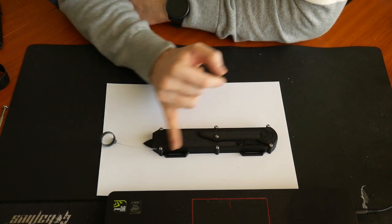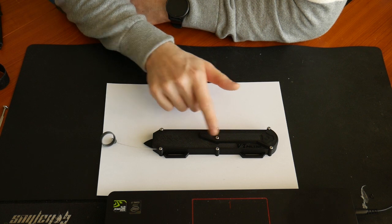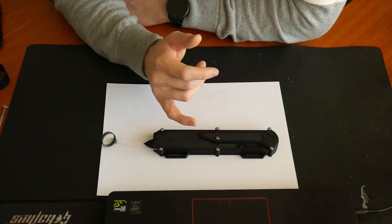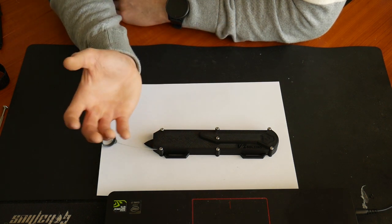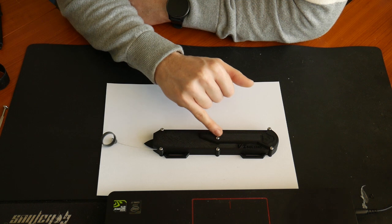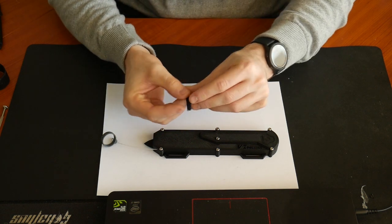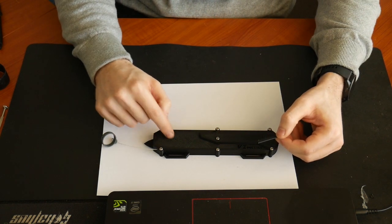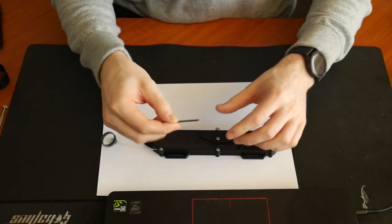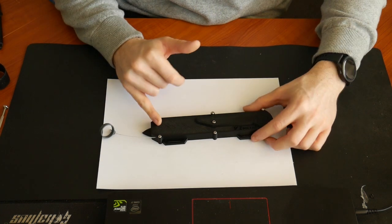You can see there's just that bit at the bottom that snapped off. I think I know why this happened - it's because of the gear ratio. We've only been looking at it in one direction, from the back towards the front, where it's a 1 to 32 ratio. But if we look at it from the front to the back it's 32 to 1 - quite a significant gear reduction - which means there is a lot of torque and rotational force developed at the end of this gear system. By the time the slight rotation from the blade pushing on it reaches the end, there's a lot of force on that straight gear, enough to cause that back piece to snap off.